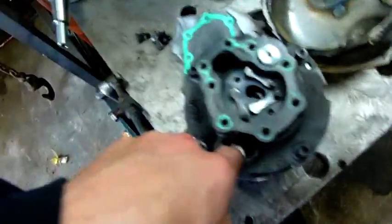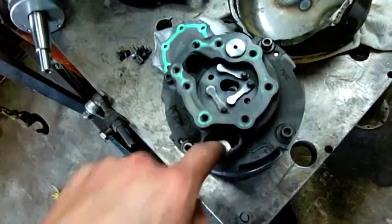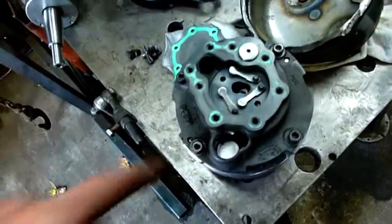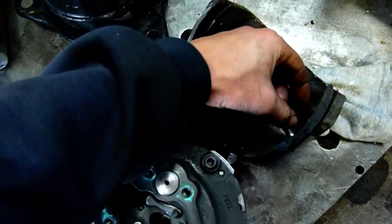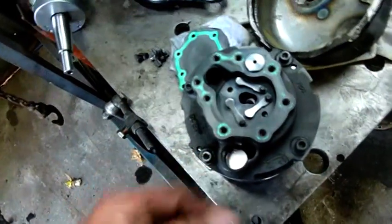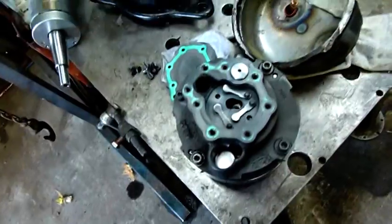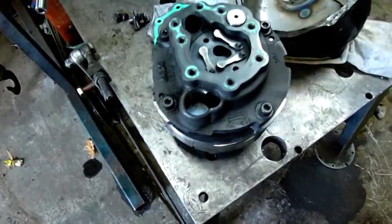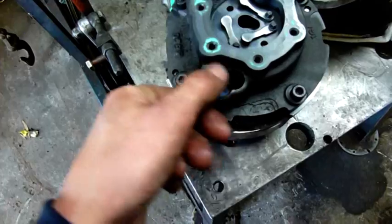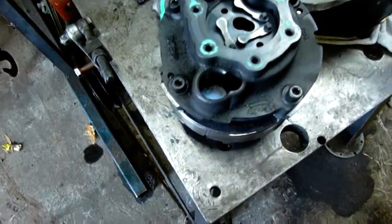Low pressure on top — that's your low pressure in from here. That feeds directly into there. It is spring loaded but it's stuck because it's got crap and grinding dust underneath it. It's a little spring-loaded plunger — actually, it's a check valve. Once the extension of that piece I cut off sits down inside that hole, once that valve comes up it will check the flow. So once the compressor stops, you don't get gas flooding back to the low pressure side. It's just stuck. Normally it's supposed to spring up and sit flush with the top of the housing at maximum extension.